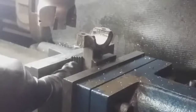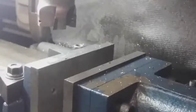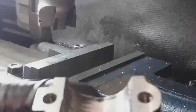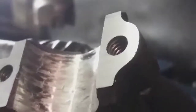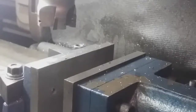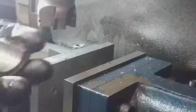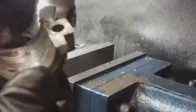So I used part of my clamping kit because I couldn't figure out how I was going to be able to clamp it in the vise. I didn't want to go sideways - I wanted to almost do a fly cut on the top. I think that'll work. I'm going to pause this so I don't waste a bunch of time. I'm going to set the bottom piece up in here. This one has all these different steps, that's why I did it this way. This one I can just clamp on the outside like this, then indicate it and stuff. I'm only going to take a few thousandths off, so that should work.